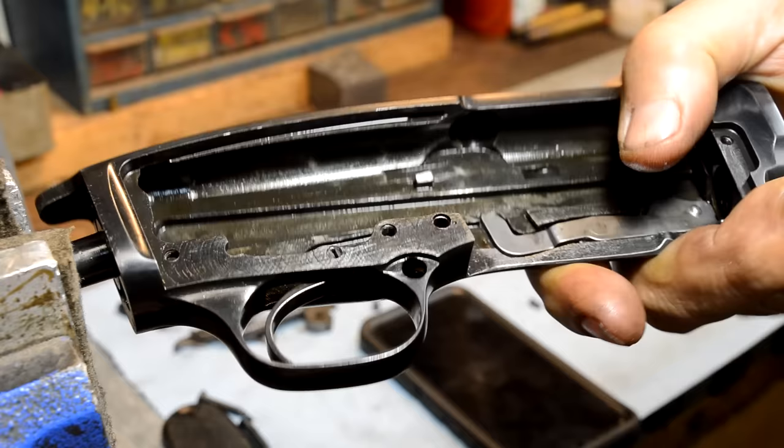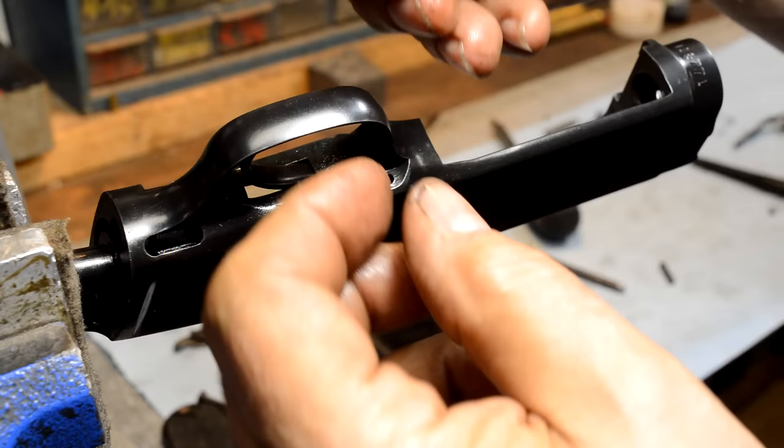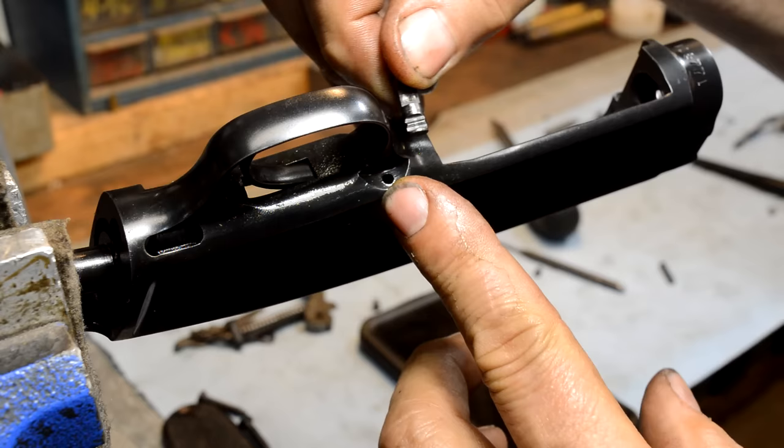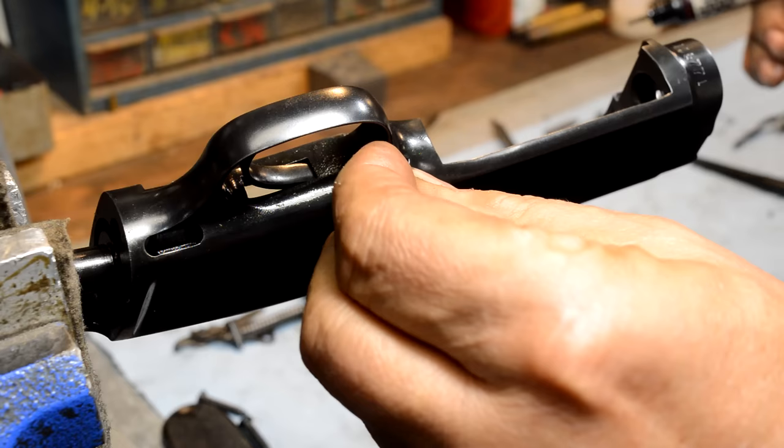All right, we need to be in upside down like this. You remember when we took it out? Okay. When we put this through, we're gonna put it through with the flat side in, and then we're gonna roll it around so that it comes up, so it'll go in this way. And then we want to be right on the top of this when we're rolling in, bang, and it'll come down, all right? So we're gonna put a dollop of oil up inside that hole there, because I'll guarantee you this first time this thing's been lubricated in forever.